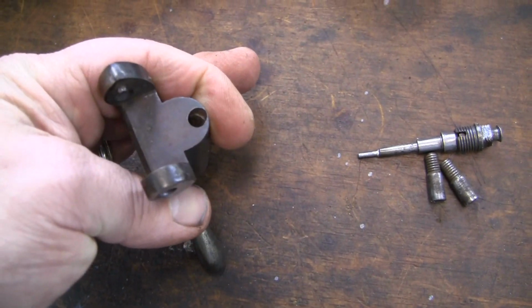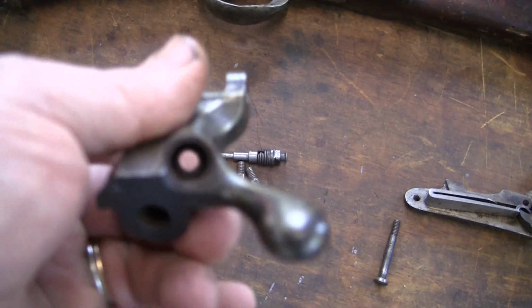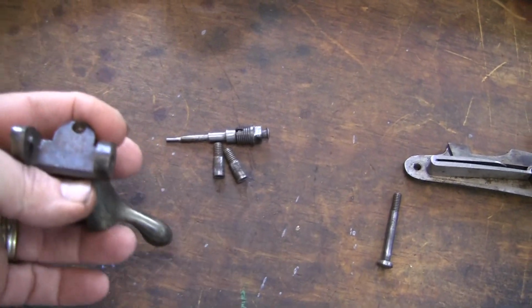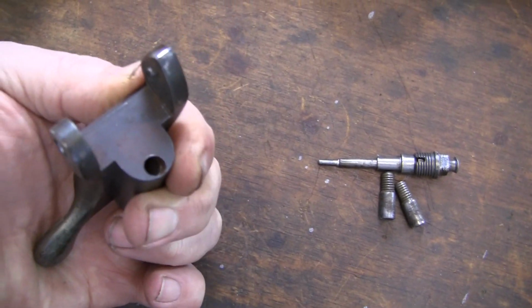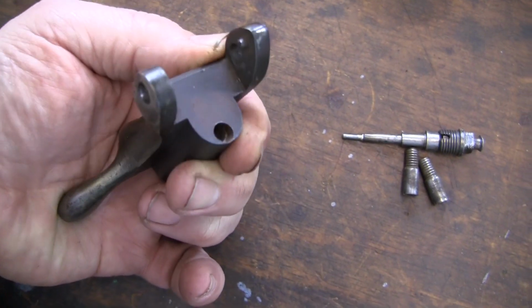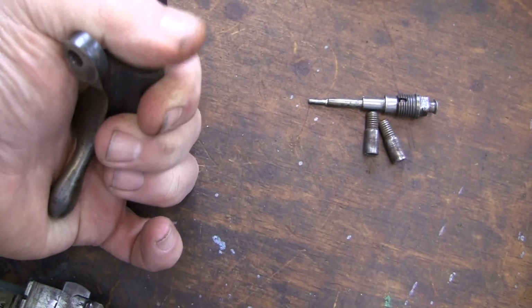They drilled a humongous oblong hole. And what they did is they just went through, shot a hole through to get the busted end of the pin and the screwed up end out. So if you look, there is like a little lip in there. I'm going to have to make some kind of plug and try to silver solder and get it to rest on that lip. So in other words, when the pressure comes back, it just holds in there.